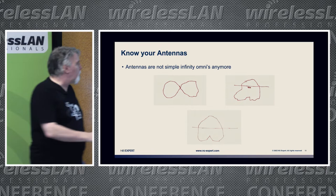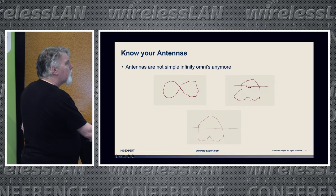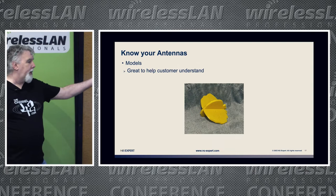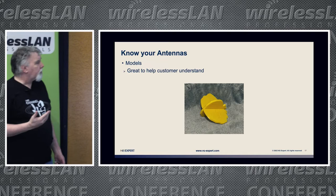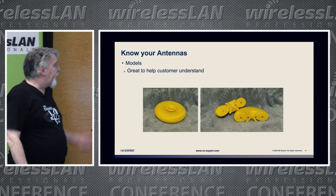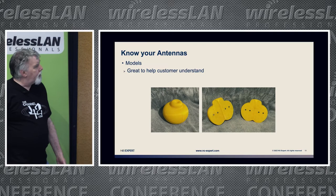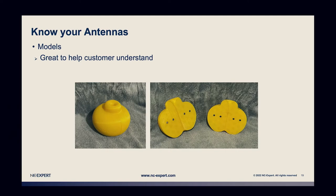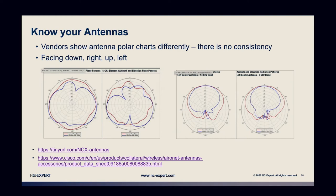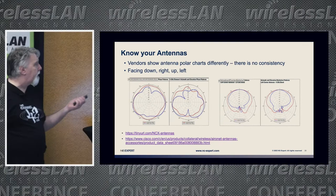All AP vendors like to force the energy downward — why send energy up to the ceiling? The pigeons on the roof don't want Wi-Fi. A friend of mine creates 3D antenna models: you give him the antenna information and he builds a model so you can visualize how the antenna operates from the polar charts. You can see the dramatic difference between the classic doughnut shape and the butt-enna Ms. Pac-Man ghost shape. It's very important you understand the coverage of your antenna because antennas can make or break your design. There's a great resource called 'Maths and Physics for the 802.11 Wireless LAN Engineer' by Joseph Bardwell — just Google it.